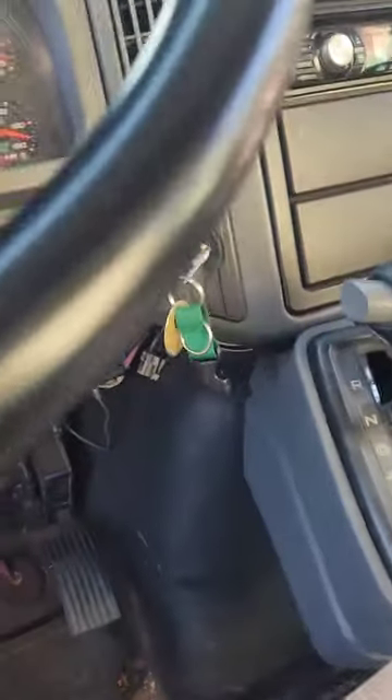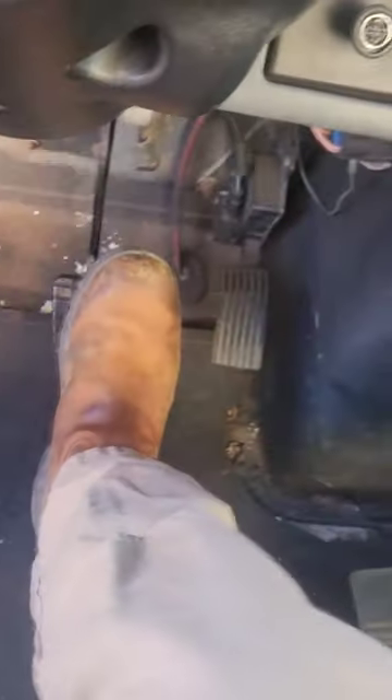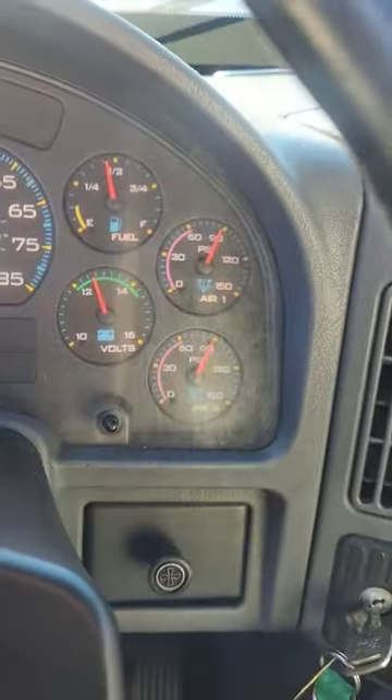The examiner's going to get in the truck. I'm going to turn the key one click to the right. I'm going to check my air pressure. You can do this before or after — I like to do it before I put the chocks out. I'm going to make sure I'm below 90 PSI. If I'm not, use your service brake and pump it down below 90.